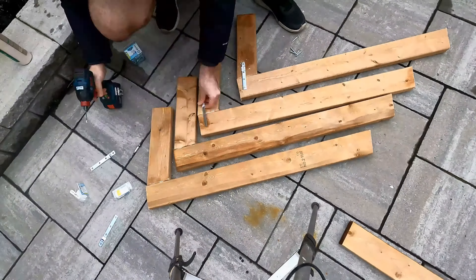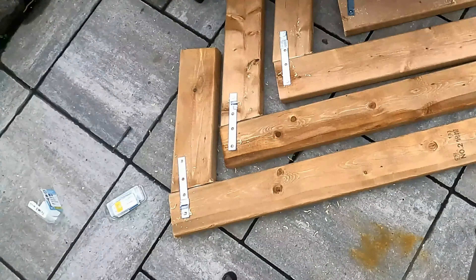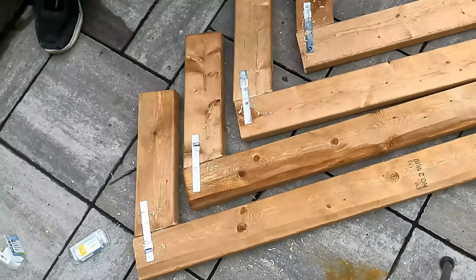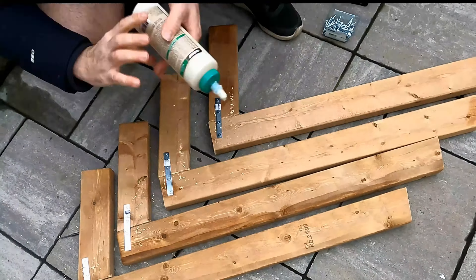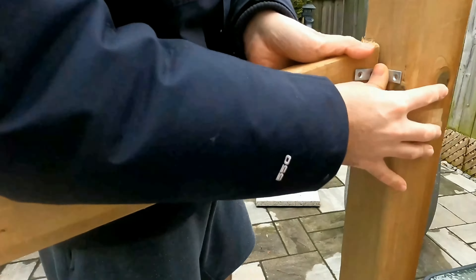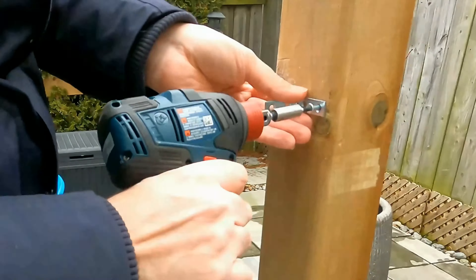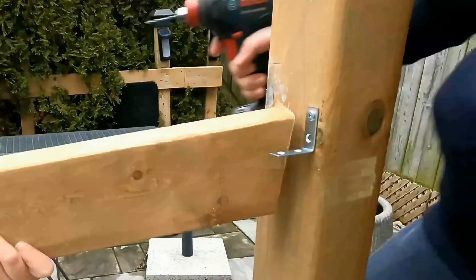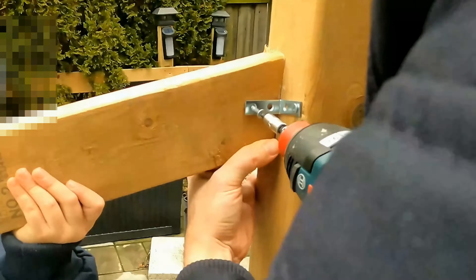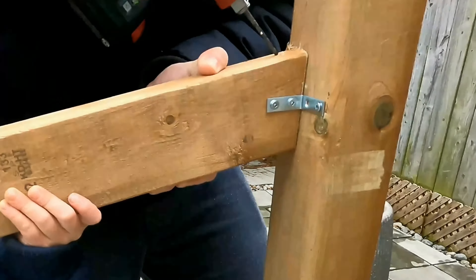For the next step I made the arms where the kayaks will hang. I made the cuts at 12-degree angles so the arm will dip a bit down and the elbow will go straight up. Each arm is two and a half feet in length — probably a bit too much and I should have gone with two feet or less, but I figured some wiggle room would be nice. I used glue and metal braces to make sure the arm would be able to handle 70 pounds of kayak weight. My heaviest kayak is 70 pounds and the lightest is 30 pounds, so that's the only weight it really needs to hold.